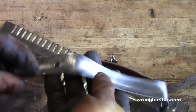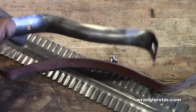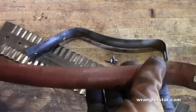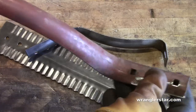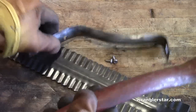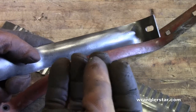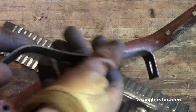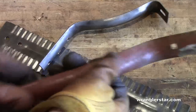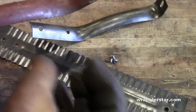I've got the paint stripped off of one of the side supports and that is going to be nice. There's no reason to have paint on tools — unless it's your custom to leave them outside in the rain — but tools that are taken care of, oiled, and kept sharp don't need paint. Some people might recommend glass beading or sandblasting, and yes, it is quicker, but what it does is pit the surface and creates almost the perfect environment for rust to start. Having a nice polished wire brush finish almost burnishes and polishes it, giving rust a hard place to get a foothold.